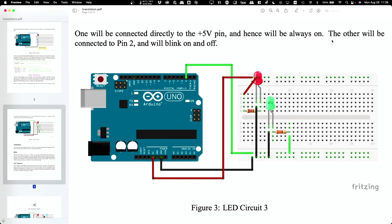Okay, and now you need to connect this to that and this to ground, but there also needs to be the resistor. So for example, we could get a shorter one, right? The positive side is on the right. So put this here, then go to the resistor on the negative side. You can bend it like that, or you can just go across the bridge, and then do one more to connect it to ground. Right? Now, it doesn't look exactly the same there, but it's equivalent.